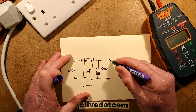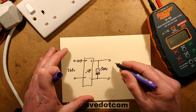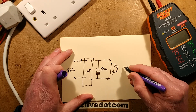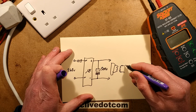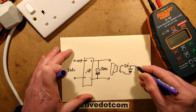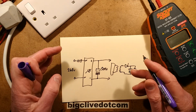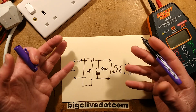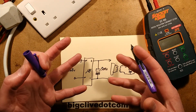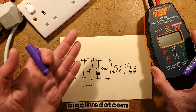At that point the circuitry will be running, as long as there's no load connected. If there's a load connected it would actually show a much lower reading. But if the output's floating, the circuitry will run that little transformer, and the output from that will be going through a diode and charging a capacitor up. There may be a very slight load across that, but once that circuitry has run and charged the capacitor up and it's stable, it will draw a very low current because the circuitry has a very low standby current. And that is what the meter will actually read - it will interpret it as a resistance, but it's not actually a resistance, it's just measuring a current that happens to show a resistance for that particular level.